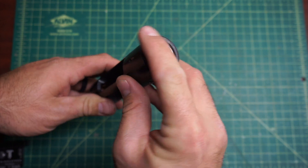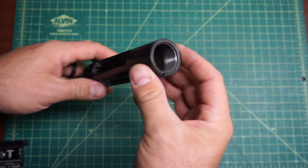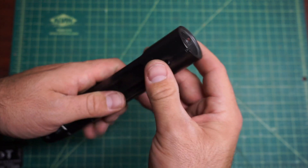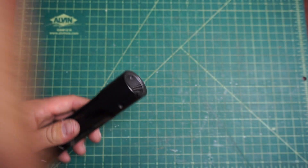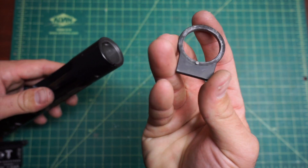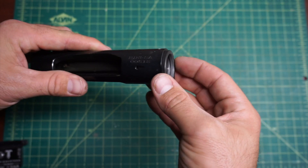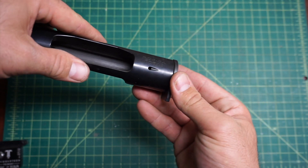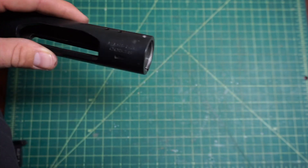These hold a very tight tolerance, so you can get pre-fit barrels from your favorite barrel manufacturer. You'll notice here on the front, the recoil lug actually has a little pin that aligns with it right there. So you don't have to have a wrench that is going to hold that in place, because it's not going to spin due to that pin. Very nice.